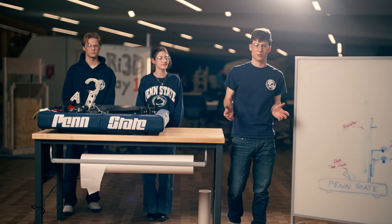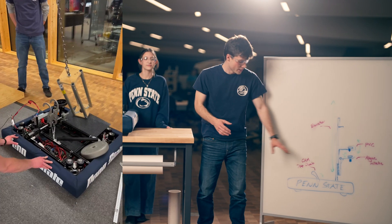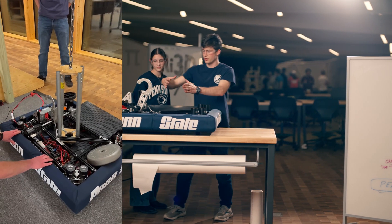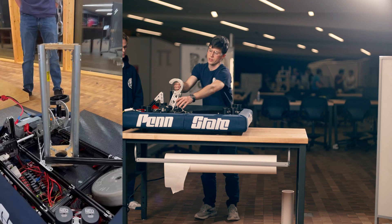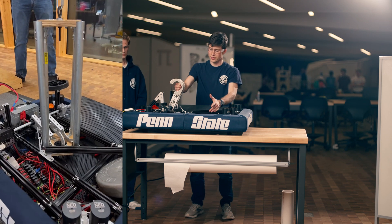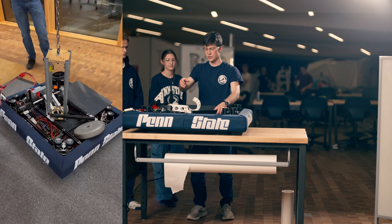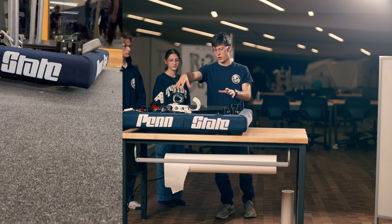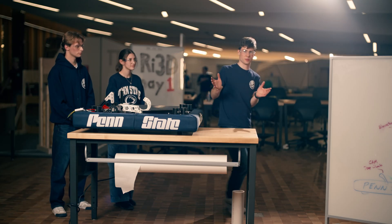The other mechanism we're going to move forward with is a cam to do the deep cage climb. Your robot drives into the deep cage until the cage comes right in the middle of the robot. Then this cam, driven by a highly gear-reduced Neo, drives down and pushes against the bottom of the deep cage to lift the robot just two or three inches off the ground. We think with our weight balanced well enough, we can get off the carpet. That's what we're building tomorrow — thanks for watching our day one recap.